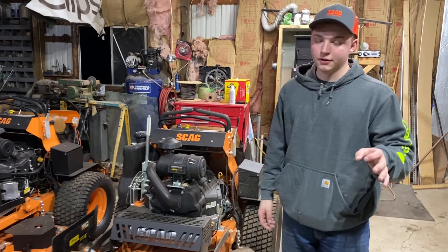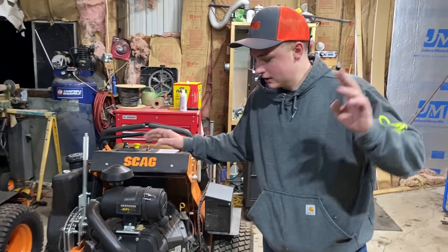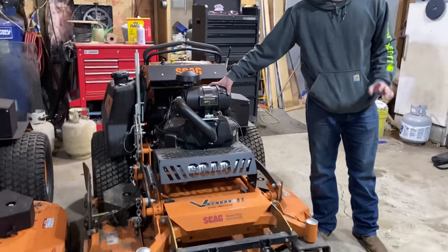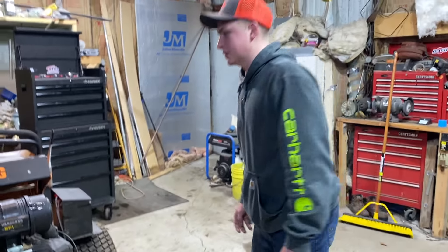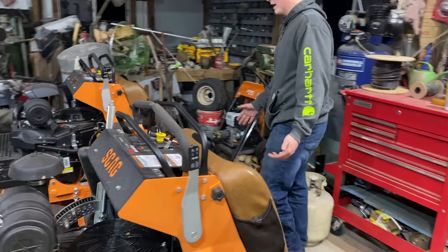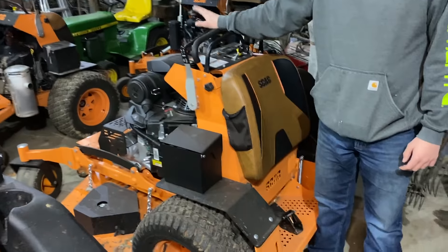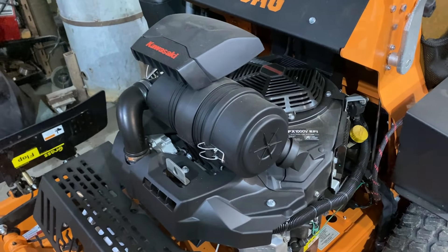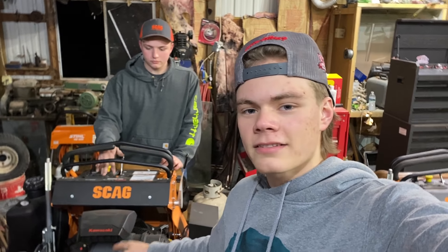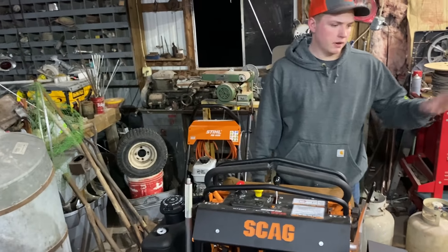This is the first 37 EFI on a 52 in the tri-county area, so I'm told. These are all 2022s. This is our 52 with a 37-horsepower big block Vanguard, and we have a leaf plow bracket on it. We run the Jerco, which you guys will see later. I took this out on an overgrown lawn - it was about a foot tall, hadn't been mowed in about a month. At 8 a.m. that morning, this thing threw grass with no clumping at all. The Scag deck has 18 inches of discharge where your Toro and Exmark only get about 14 inches - that extra four inches really helps.